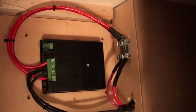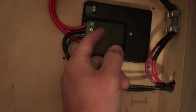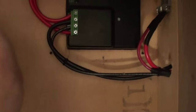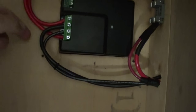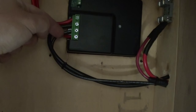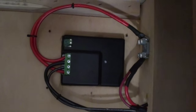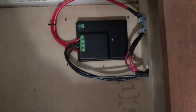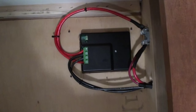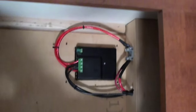There she is all hooked up. Depending on your charge controller, you are going to have a positive and negative going to the battery — those are the thicker wires at the top. Then the thinner 10 gauge positive and negative are going from the solar panels into the controller. There are leads for a temperature sensor on the batteries, which is highly recommended. It is going to be a pain for me to run that wire right now, but in the future I may connect it because it does give your batteries a better charge, especially in wintertime.